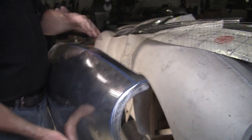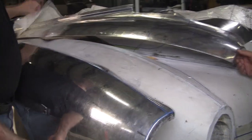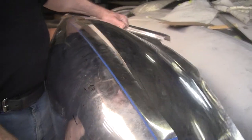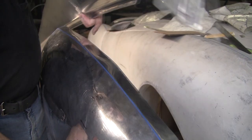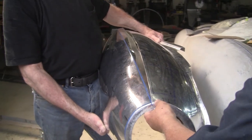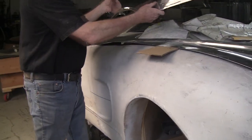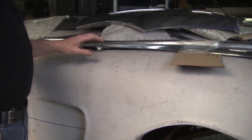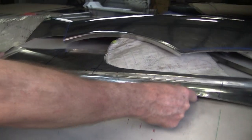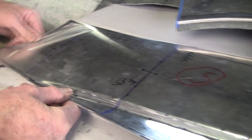This panel needs a little adjustment — a little bit of shrinking — and then with the weld index mark, this section has been welded together here, and that's going to get welded on to give you almost the whole fender right there. This back section was made by Joe, one of the sons from Ohio — Mike was the father. He did a beautiful job with a lot of tipping wheel work, and there's a nice little roll here where it goes into the cockpit.